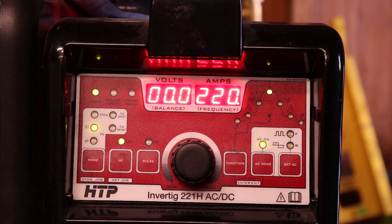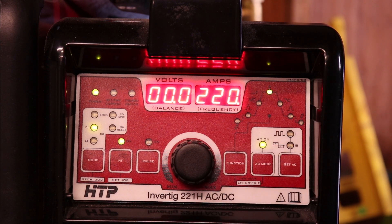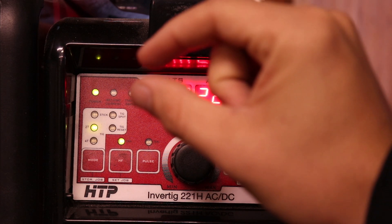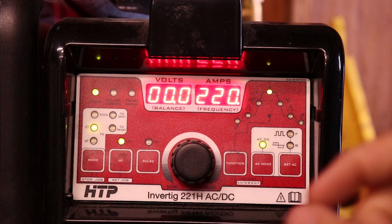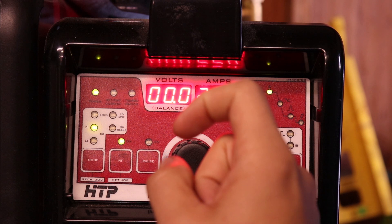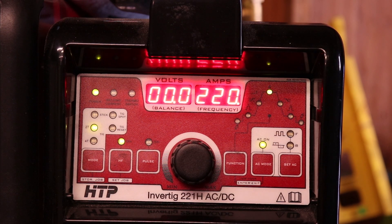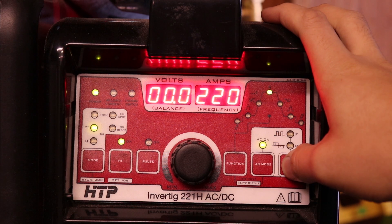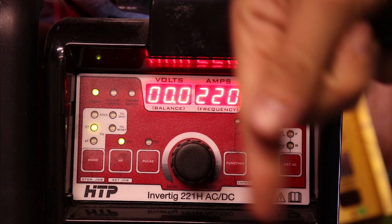71 balance seems to help especially if you can't wire brush your material. If you have nice clean wire-brushed material, 75 is fine — I could have probably gotten away with it but I didn't want to take the chance of getting crud in the puddle. When tacking I like 200 Hertz because it makes a narrow bead, and I'll run about a half-inch weld on something important as a tack — a narrow half-inch long bead on the core to the actual fitting — so when I'm welding it's not going to snap. Since 200 Hertz is nice and narrow, I can weld over that. I used 200 Hertz when doing the fillets on the inlet and outlet.